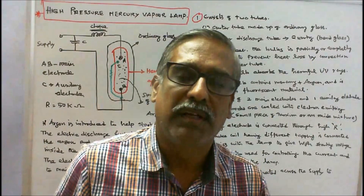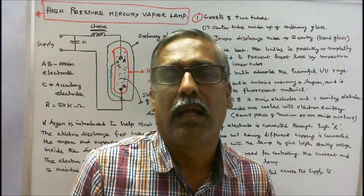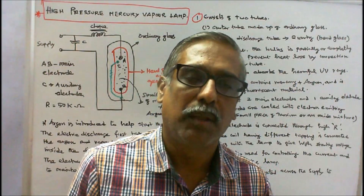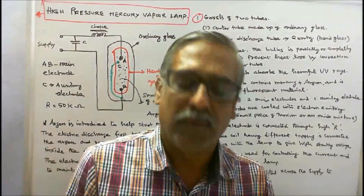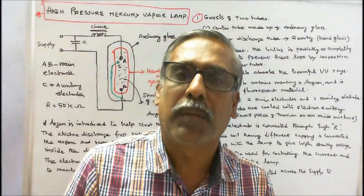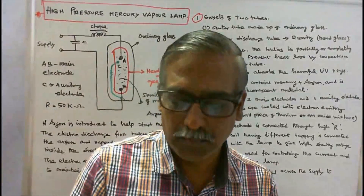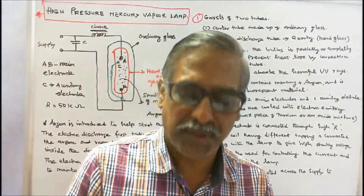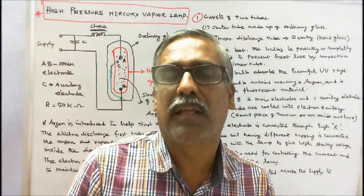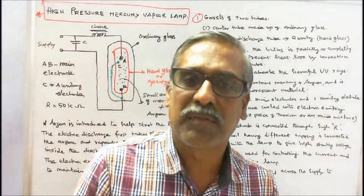This class we discuss about the constructional detail and operation of a high pressure mercury vapour lamp. John Thomas Way developed the mercury vapour lamp in the year 1860 and tested them on Hammersmith Bridge in London. The modern high pressure mercury vapour lamp was developed in the year 1936 by Philips, with no individual names available.